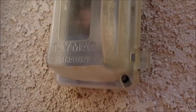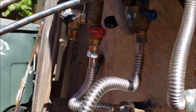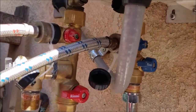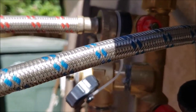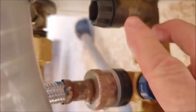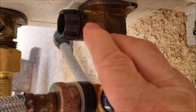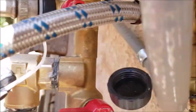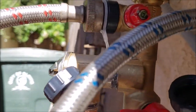After 45 minutes to an hour, unplug the pump. The cold line and hot line are still attached on this side, same as before. First, unscrew this right here and clean out the filter — this guy right there. Unscrew to the left, pull it out, there's a screen in there, clean it out, and put it back in. We've already done that, so that gets cleaned first.